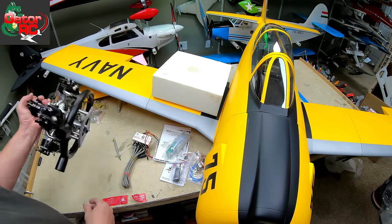Super awesome, let's check out the inside. The chinking looks really nice, well applied, no gaps. You know how well it's bonded to the surfaces? All the way back through former, former, former. If you were worried about any rigidity, it would be easy to lay a carbon rod from here all the way down through on those holes and just let it epoxy its way down. But I'm not worried about any tail rigidity — I think that thing's going to be pretty solid.